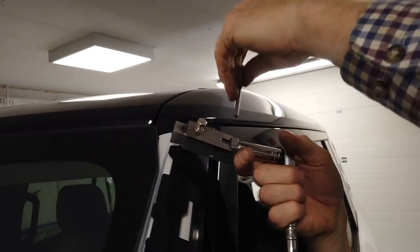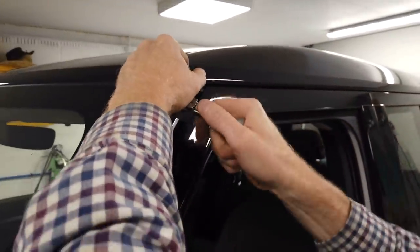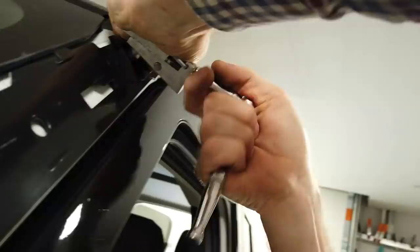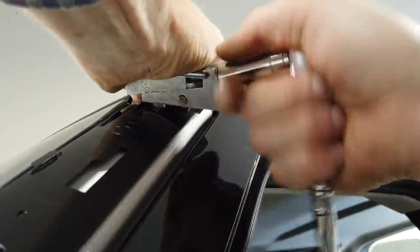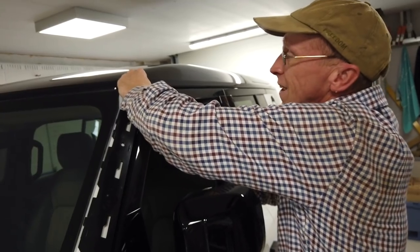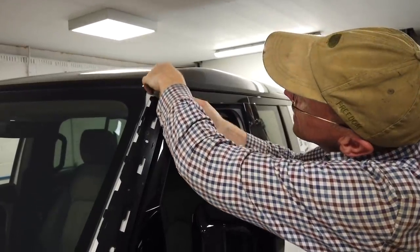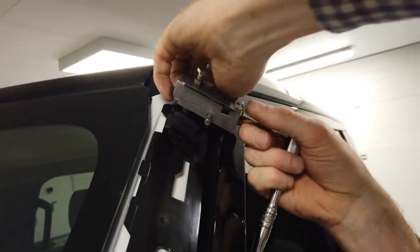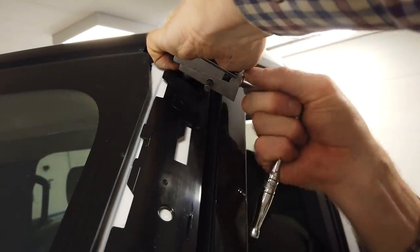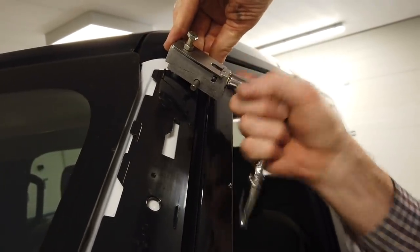There's a little bar I can put in the tool to stop it twisting. So I put that bar in there to stop the tool rotating. As the wedges slide it compresses the rivet nut, but it's made tricky by two things: one, the rivet nut isn't the right size for the hole — the hole's too big — and two, there's a standoff, so I've had to find a little spacer to put underneath because you can't get the rivet nut tool right next to it.